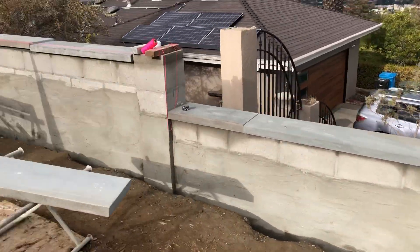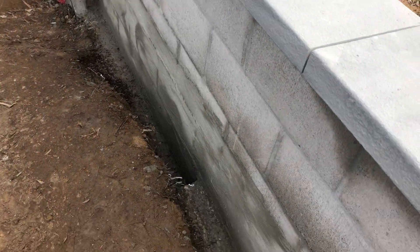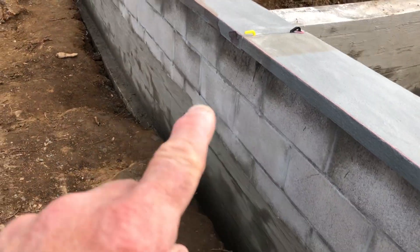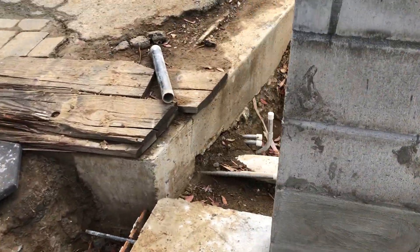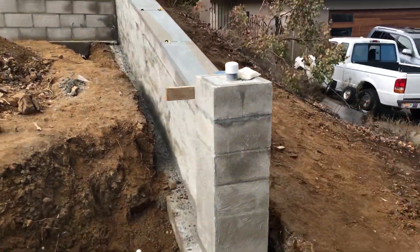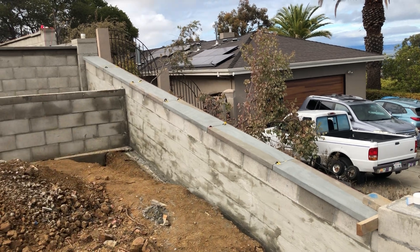I only apply the uphill side, and we had about 200 to 250 feet to apply in this case. Let me jump to the other side of the wall — in this case I'm not sure what my neighbor is going to do on his side, so I went ahead and added some waterproofing coating to the bottom foot and a half. That way if he wants to build up the dirt on his side, I don't have to worry about efflorescence on my side of the wall.